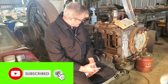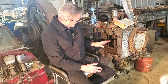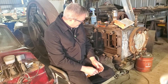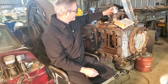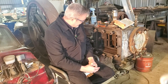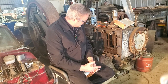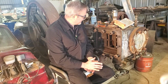Well, I hope you enjoyed that. I know that it was fun to do a little bit of work to make some progress on this. Once I get a reasonable contact pattern established with the bluing on here, I will try to run this on air once again. I've got it set up for 1 inch airline, and I've got to get the big Quincy compressor running again, but I'd like to get this at least spinning and start to see if there's any issues with the mechanism, the timing. I don't know if the timing is correct on the engine. It appears to be correct, but lots of fun projects we can work on.